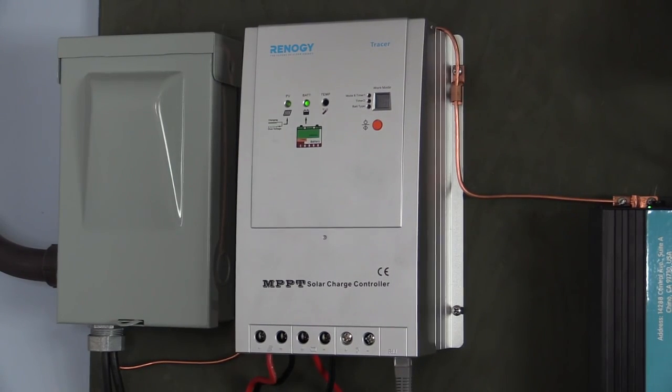First, the transmission of the power is far more efficient. More importantly, I can use thinner, cheaper wire. In my case, wiring the panel 60 feet away from the controller, I was able to save enough in the wiring alone to nearly pay for the cost difference between the PWM and the MPPT. For me, it's a no-brainer. For the same overall cost, I can gain efficiency.